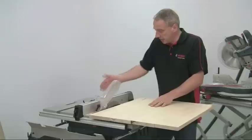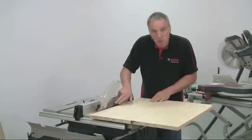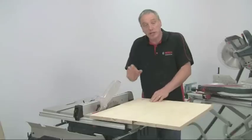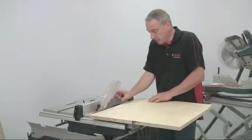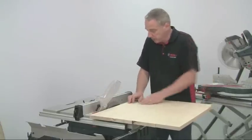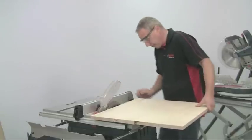The next stage is to cut out all the pieces from the boards we've made up. For this I'm going to use the GTS 10XC table saw. I've fitted a coarse rip blade — since these are all rip cuts at this stage, a coarser blade gives a much better finish and won't burn like a really fine blade will. I need a couple of 70mm pieces to start with and then a couple at 165mm. Don't forget your safety glasses.